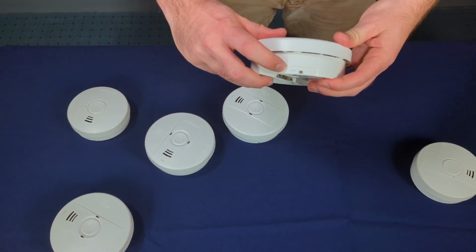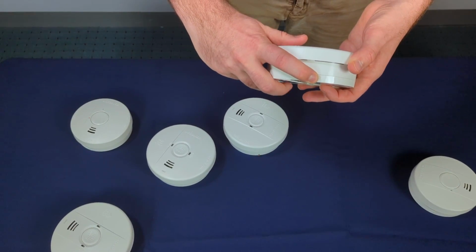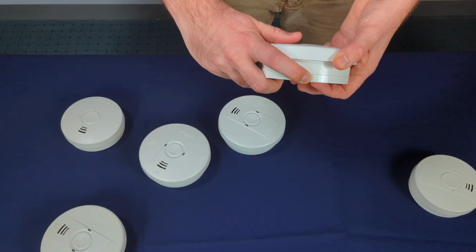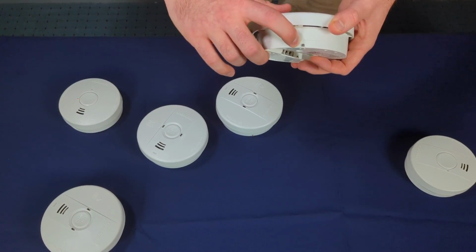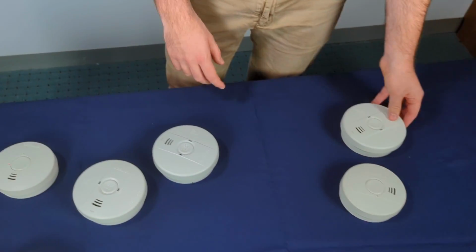Same goes when you're removing a wireless base from the network. While the network is open, press and hold for 10 seconds. Now you don't get any noise out of the wireless bases, so that's why 10 seconds is the general rule of thumb. Take your finger off. Now you will get 4 flashes, but once it stops flashing after you press and held it for 10 seconds, you're generally good to go. Now both of those alarms are removed.